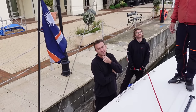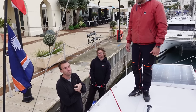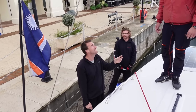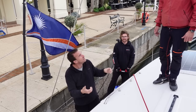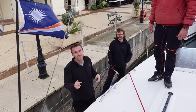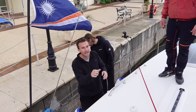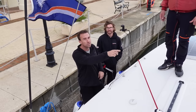So the disconnect, the place where Cape Town is getting it wrong, and the instructions I was sent, which are wrong, is they say, bring the external shrouds to 3/4 tension. So what happens in reality is the riggers do them up lightly, then they wind this to 3/4 and then that to 3/4. But what he's saying, to stop the mast twisting, which you see almost every boat has got a twisted mast, is you have to do these up with your hand and then stop, and then go two turns, two turns. Which makes a lot of sense.